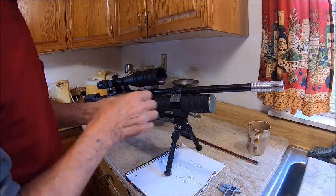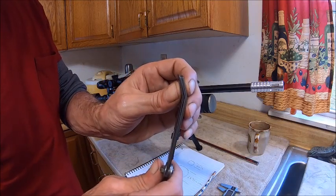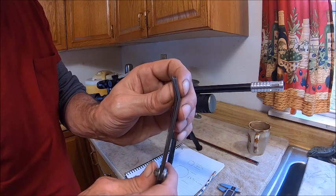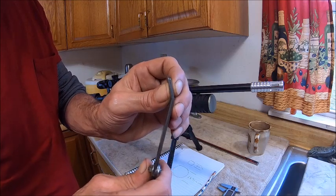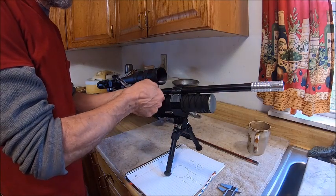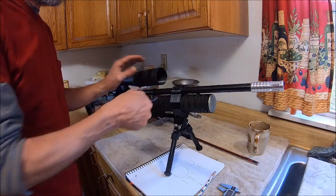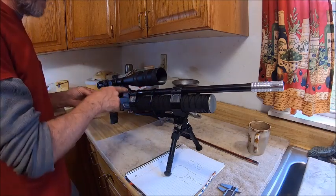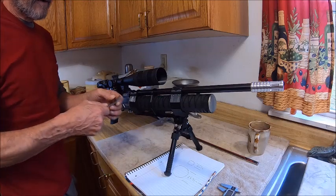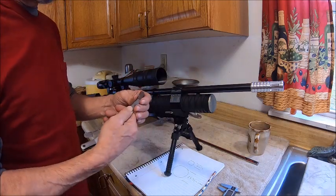It was squeezed out, because you see when I squeeze it and let off, it squeezes out. That's what it was doing. It was making me think that it was tight. So I had to put it in there to where it's got a nice firm slide in it. And you're going to be doing that up here, so there's not going to be any flex. If you do it out here, there'll be flex, and it's going to give you a false reading.